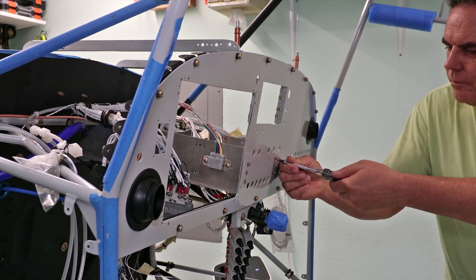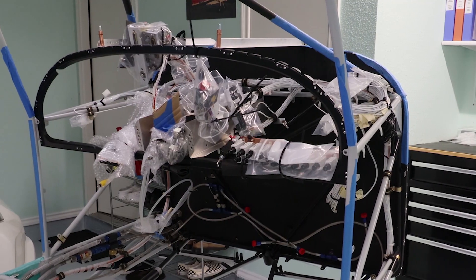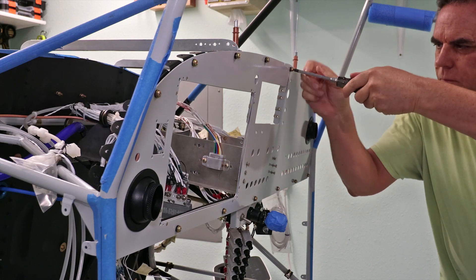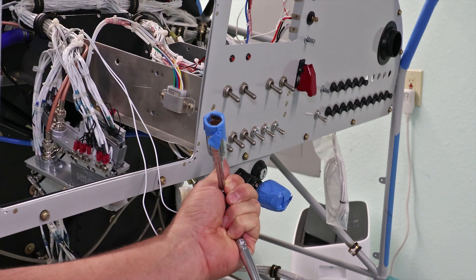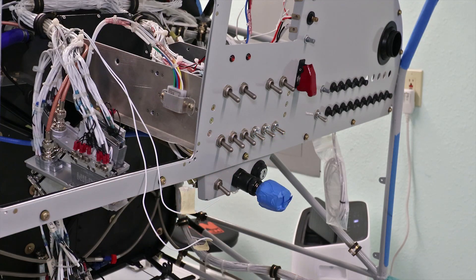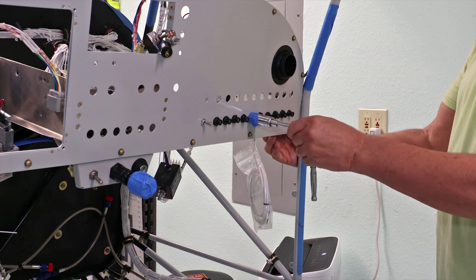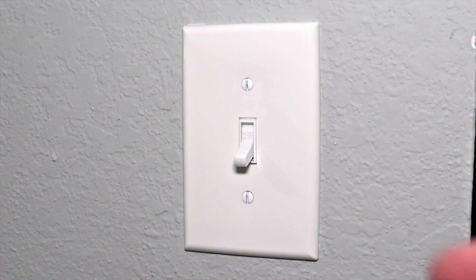Next was to install the instrument panel, which I had powder coated before leaving Salt Lake. When building up a wire harness it's always a good technique to encase completed connectors in plastic bags, as it keeps dust or construction debris off the connector pins preventing any intermittent problems down the road. The instrument panel went in easily as my extensive prep work and careful measurements paid off. When installing the switches and breakers I covered the socket with tape so as to not mar the panel surface. And just as an aesthetic thing, the mounting nuts are all tightened so the hex points all line up vertically — a long-time tradition with professional-looking instrument panels, just as you would with screw slots on switch panels in your home.